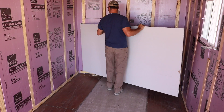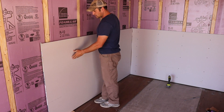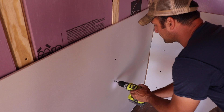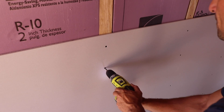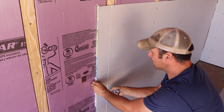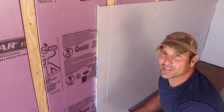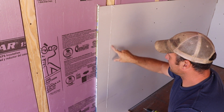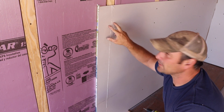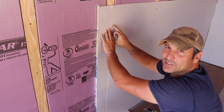Now I'm ready to clad this in some drywall and some plywood and some other things, so let's get started on that. I'm not a drywall expert and I've only done a little bit of patchwork in my previous life. What I'm trying to do right now is just make sure that the drywall meets on one of these studs to make it easier for me to line up. I know that's not necessarily how they do it all the time, but just for my own ease of getting everything secured down.